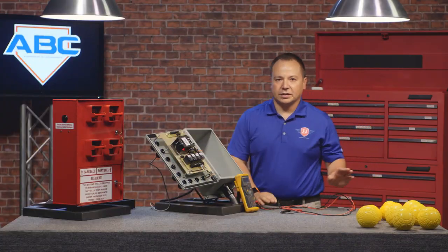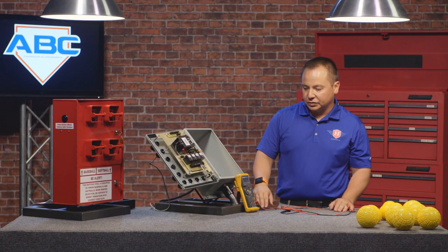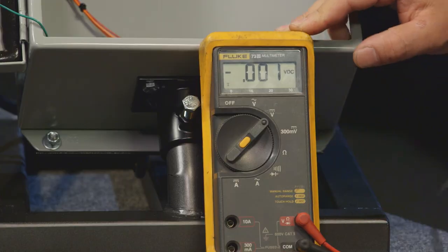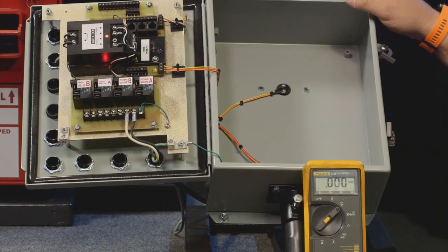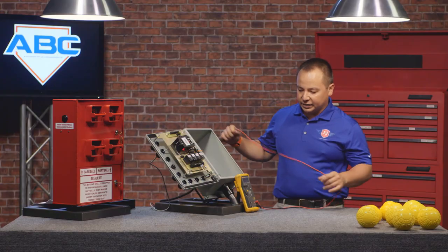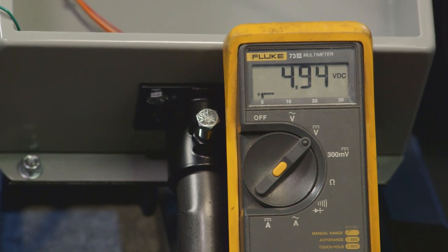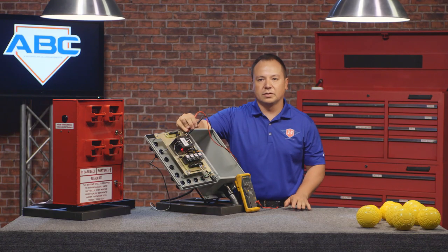The second critical function for troubleshooting is DC voltage. DC voltage is used for switching in our application. The symbol for that is a V with usually a straight line above it. We use DC voltage in places like the ball count microswitch — the circuit board is outputting 5 volts at all times to it. We can test that by touching our test leads to where the ball count microswitch wires, and we're getting 4.94 volts, approximately 5 volts. So we're good there.